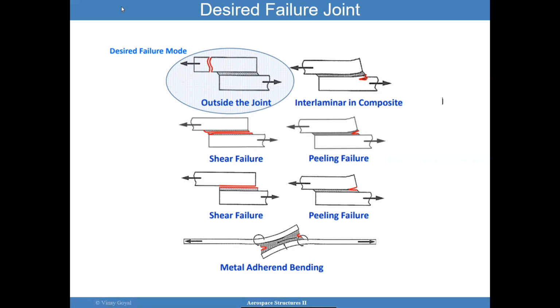Why don't you take a few minutes and go to Google and type adhesively bonded joint failures, okay? And click images now and see what you find. And if you don't find as much, maybe type shear failure, peel failure, contamination. See what kinds of failures you could have. And secondly, I invite you to look for microscopy data, looking for the voids that we talked about, and the connection of damage or defects, pre-existing defects within the joint, and the ability of non-destructive evaluation techniques such as ultrasound to pick up these types of damage, okay?